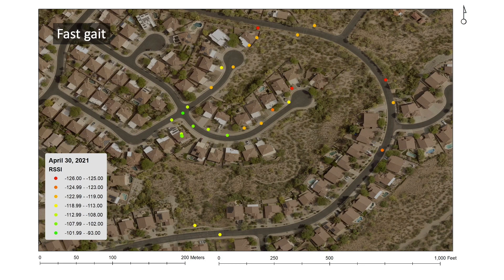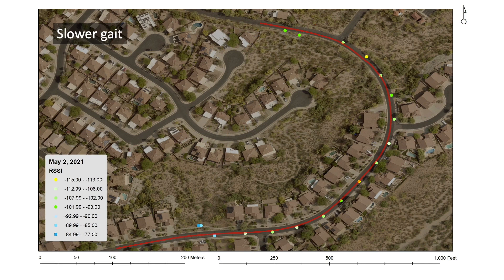To set up the comparison, this was the coverage realized with my commercial grade 2 dBi antenna while taking a relatively fast walk around the neighborhood with adaptive data rate set to off — not that great along the outer loop. And here are the results generated from slowing things down a bit. The results improved significantly, so much so that I had to add a few extra colors to the legend to capture the improved RSSI not realized in prior experiments. Assuming no other environmental or hardware factors were changed, this suggests that when moving, I can realize a better RSSI by slowing my speed during data collection and keeping adaptive data rate turned off.